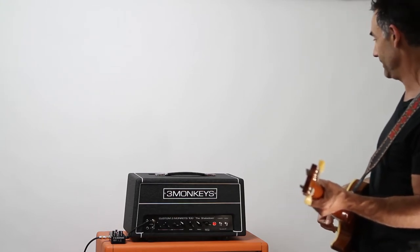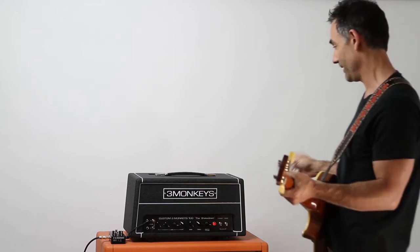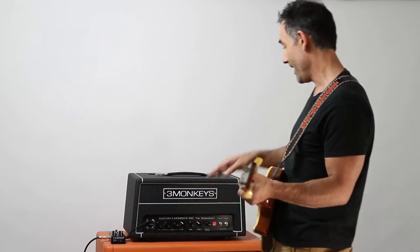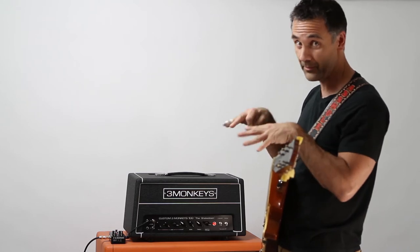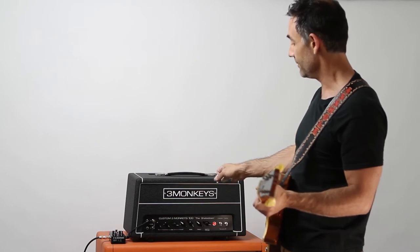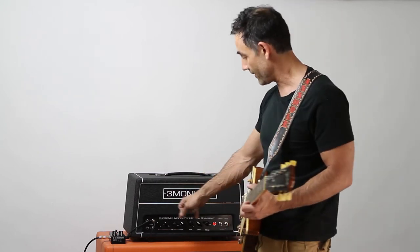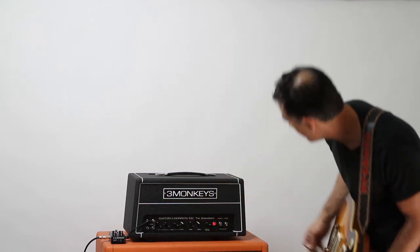Kind of dirty right now, but this is your amp, and the most unique thing about it that I think you're gonna have the most fun with is that you got four inputs that are totally independent, and they go into these four different volume controls, right? And those are all running parallel, so it's like four different amps running into the same power amp, or four different pre's running into the same power amp. So you can basically vary, like, even effects into different inputs and blend the different channels in, and they also have different coupling caps so that you get basically your fattest sound with one, and they get progressively thinner as you get up to four.